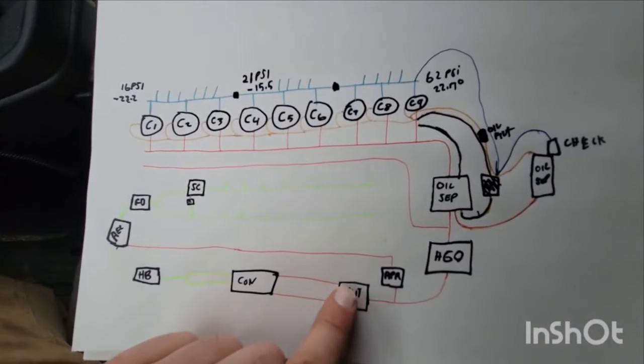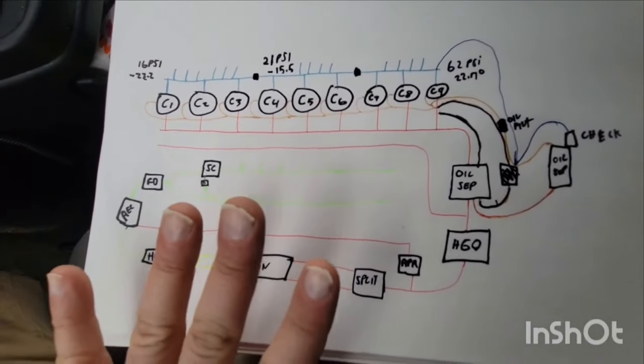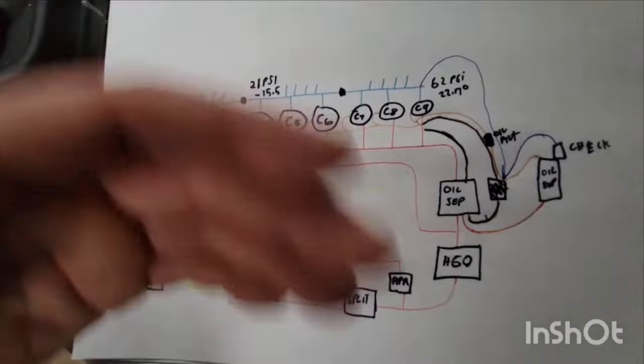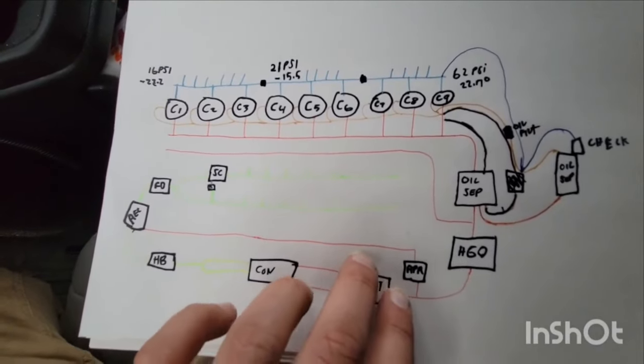So come up to the split. Okay, is this feeding right to your condenser? Is it stuck in split? Right, that's a huge one. Did somebody manually turn it on to split for the winter and now it's the summertime and you're getting high discharge, okay? Is your split working properly? That's another one, okay? Those are some things that you can look into.